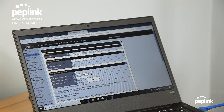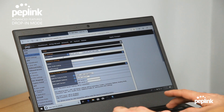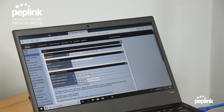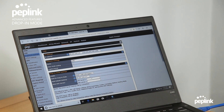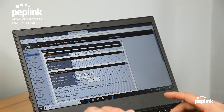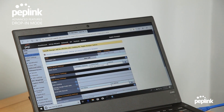I'm going to check this box — LAN1 with bypass. I'm going to put the default gateway in there: .179. I'll name it drop-in mode, set DNS to 8.8.8.8, and make sure DHCP is disabled. Hit save. There are my drop-in mode settings.